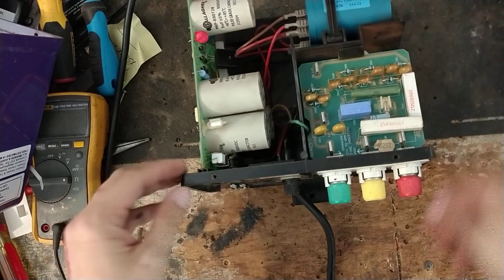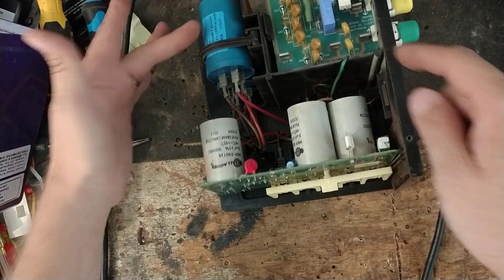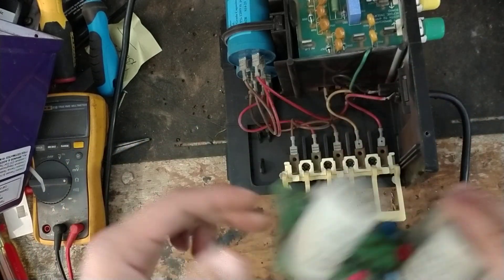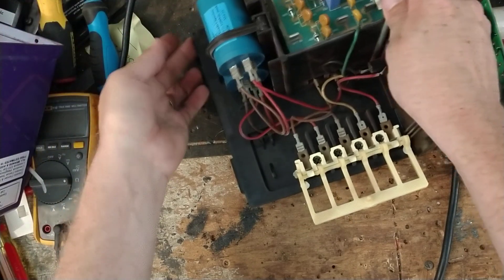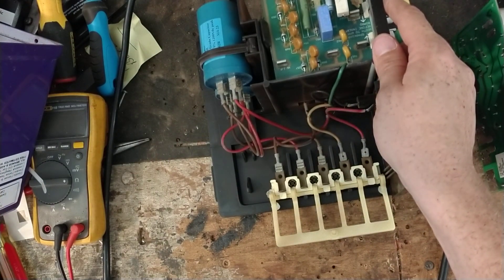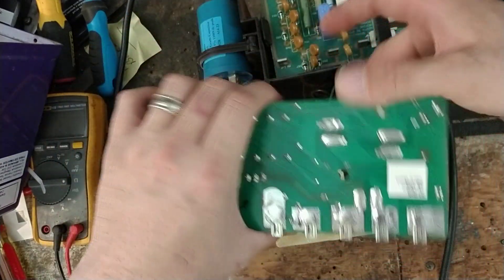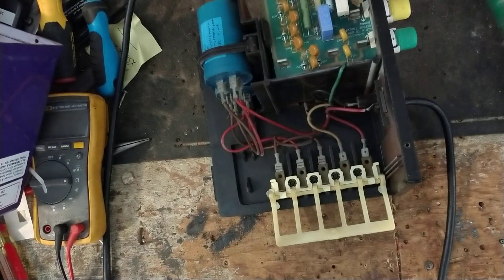That's what the inside looks like. An M800, Bev3, or MPE2 — they're similar. They all have a board here and a board there and a capacitor over here and a transformer underneath the board. But the M1500 has big capacitors, which is part of the multiplier circuit to build the charge up for the joules. It also has two big capacitors over here — both 30 microfarad pulse grade capacitors. Wired in parallel, they add up to 60 microfarads. A Gallagher M800 had a 30 microfarad, but they eventually came out with a 40 microfarad. The MPE2 has one 30 microfarad capacitor and a little board about half the size — they don't have all these big capacitors for the multiplier, so they do it a whole different way.